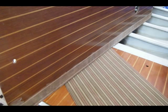Once you've got the board completely stripped top and bottom side, you're going to need to sand it. I start by hand just to make sure I don't go through the veneer — that's if it's a veneered board. This one is a veneer board with very thin veneer so I needed to start by hand. If your veneer is a lot thicker, then you can use an electric sander, which will work a little bit better. Sand your boards down to about 220 to 320 grit so that your varnish will have something to grip to when you start your varnish work.